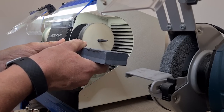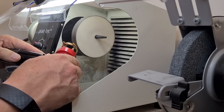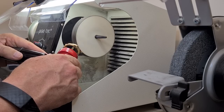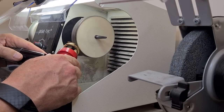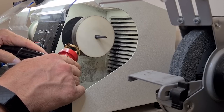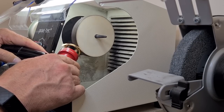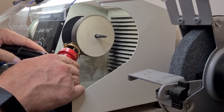And especially vulnerable is anything that's plated. Because when you polish, you will remove the plating very quickly. This watch was made back in the 50s, I believe, when they didn't do plating. They did either gold fill or a gold cap. So this one is gold filled, 10K. So we can polish it very gently, but it's not going to be able to withstand a lot of polishing.